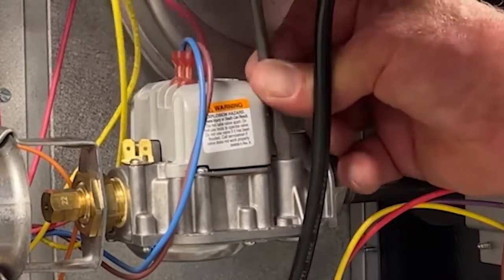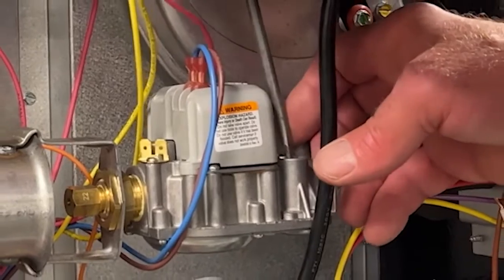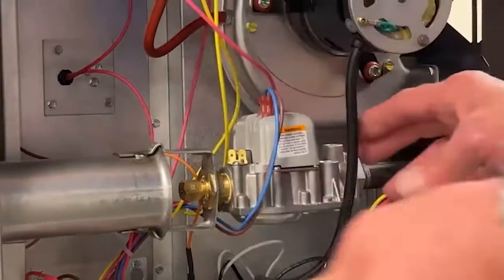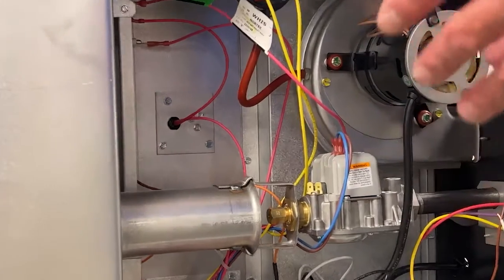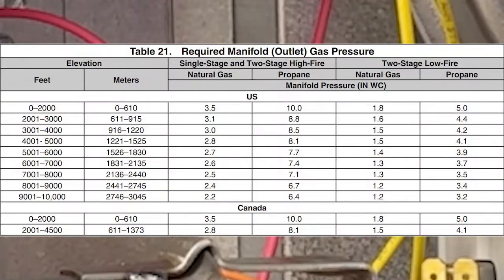You have to be careful that you don't over-tighten the regulator spring, as it can damage the gas valve and the valve will have to be replaced. My recommendation is to screw it down approximately halfway, and then once we get the unit connected to gas and energized, we will verify the correct manifold pressure. If you are at altitude above 2,000 feet, you'll need to refer to the installation manual and confirm what the derated manifold pressure is for your altitude. Any altitude above 2,000 feet elevation must have the manifold pressure adjusted for altitude.